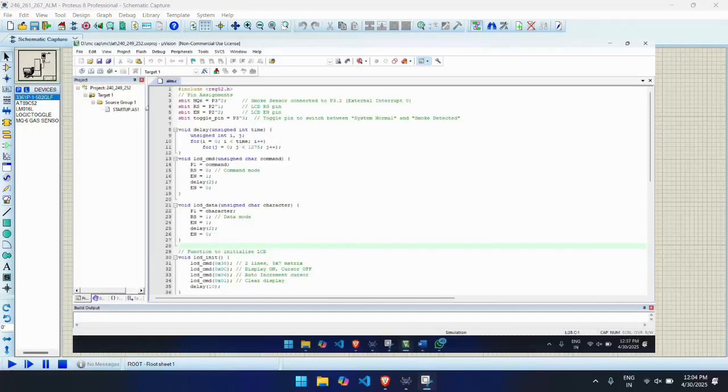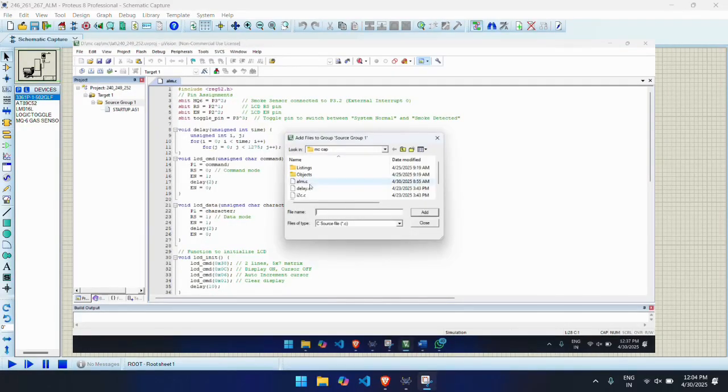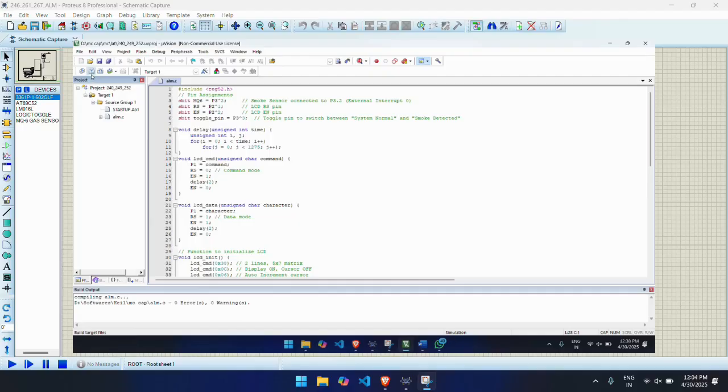For this project, we use its digital output, which sends a low signal to the microcontroller when the gas concentration crosses a certain threshold. This makes interfacing simple and eliminates the need for complex ADC circuits. The sensor is fast, reliable, and cost effective for gas detection systems.